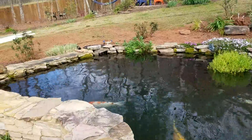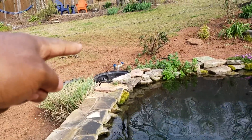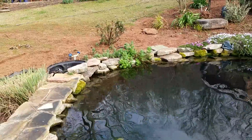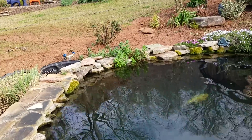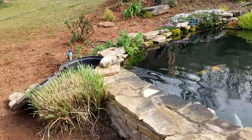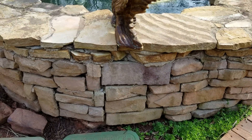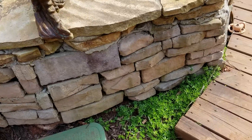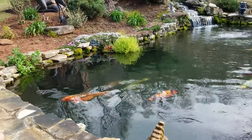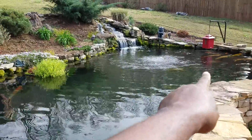To summarize: I have plenty of aeration, bottom drain, skimmers, and a flow-through system as my version of water changes. I'm adding about 32 gallons per hour of fresh water. Normally you'd plumb a designated overflow point so that 32 gallons per hour has a place to exit and doesn't create a wet spot in your yard — but this was an afterthought for me, so when the pond fills up it finds the lowest unlevel spot in the wall. At some point I'll add a more deliberate overflow somewhere on one of the edges. Hope this was helpful!